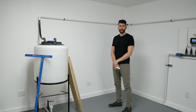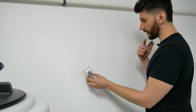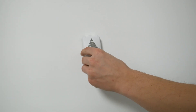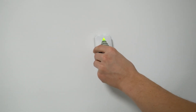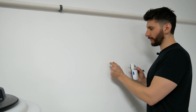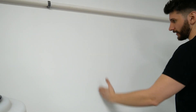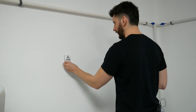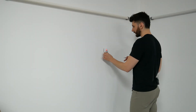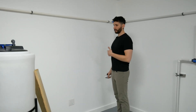To mount these wooden planks on the wall we first want to figure out where the studs are, so we need something like a stud finder. Start from a spot that doesn't have a stud, keep going in, and when it notices something behind the wall it turns green — put a little dot right there. We'll keep going until we find another stud. We found two studs now.